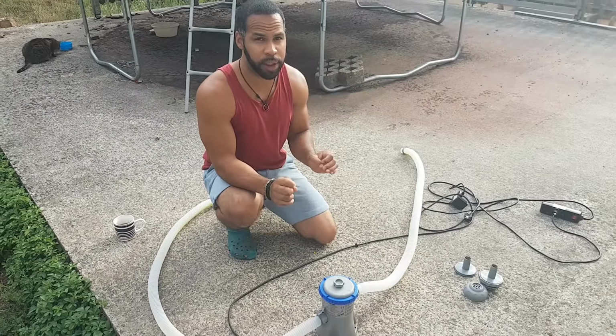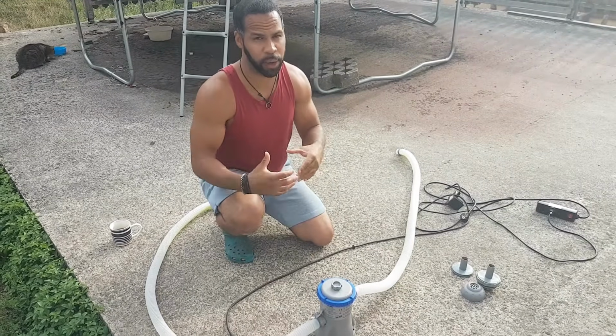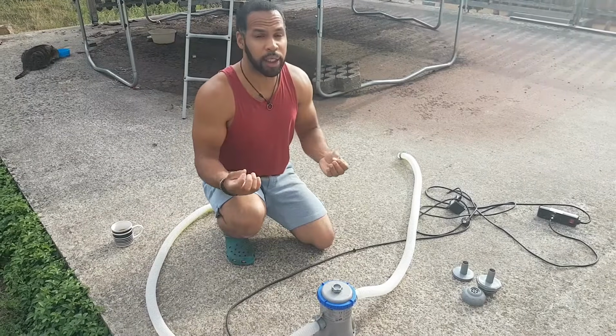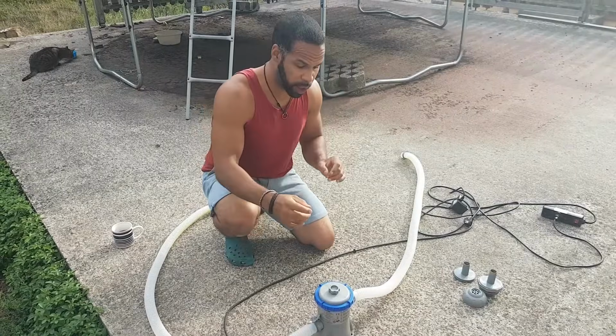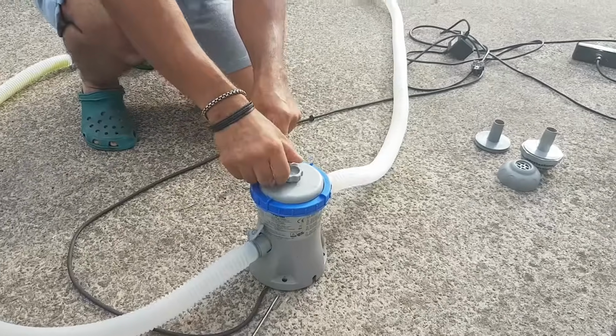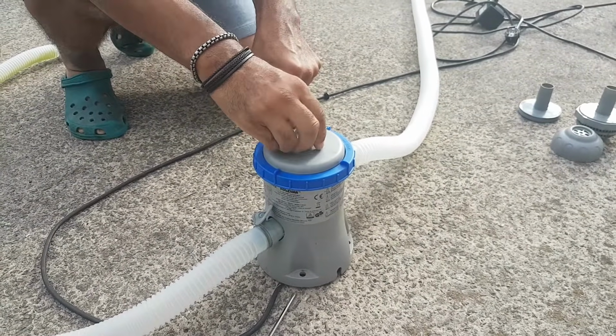So you just purchased your Bestway pool pump and you hooked it up. You looked at my instructional video and you hooked it up. So you're probably wondering, why isn't the pump working? When you first hook up your pump and before you turn it on, you want to make sure that you open up the air release valve. You're going to open this up right here, and then you're going to go ahead and turn the pump on.